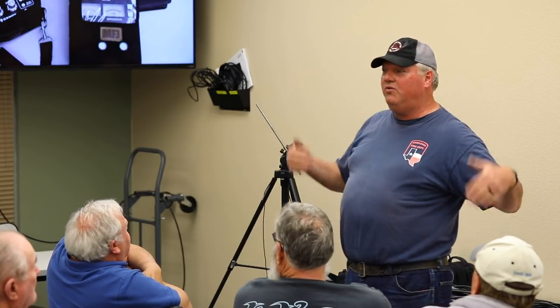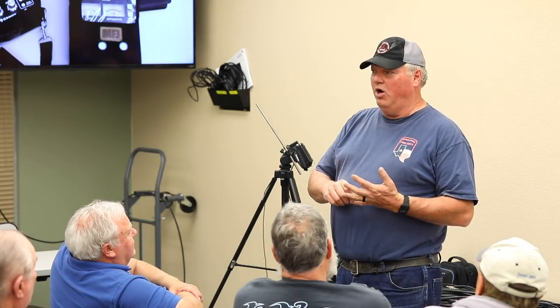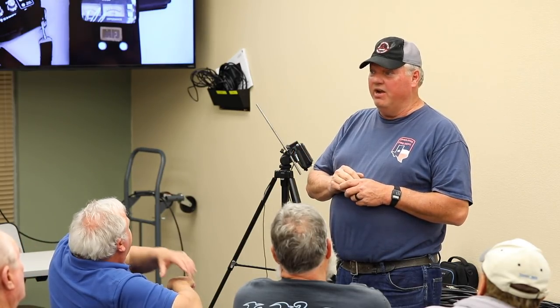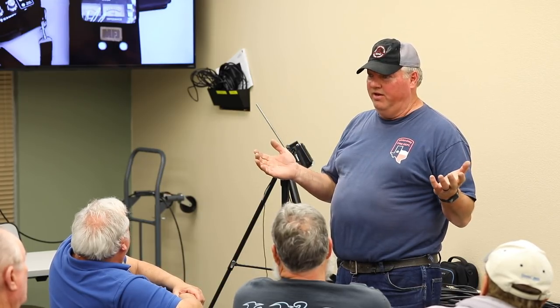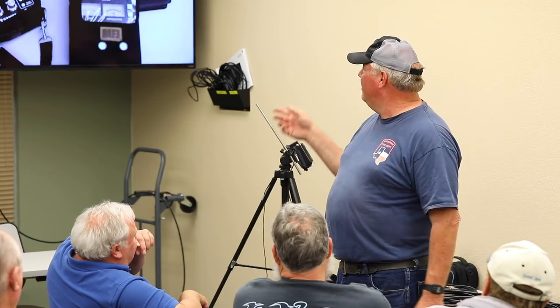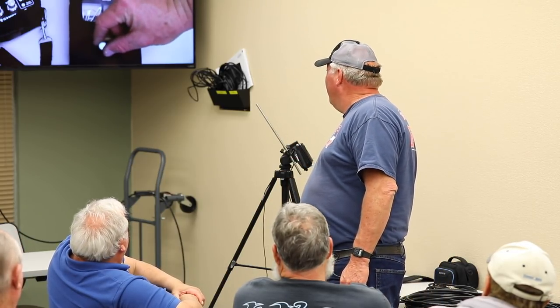You've got it so close now that you could probably not even use a tuner. On mine, when I go home and work on 40, 80, and 20, I can operate almost the whole band, not 80 because it's too wide, without a tuner if I want to. And I never get an SWR above 1.5 because I monkeyed with it. It didn't take me a couple of hours, it took me a couple of days. I played with the math, I played with the cable lengths, and I monkeyed with it until I took my little analyzer, turned the knob and went, where are we at?